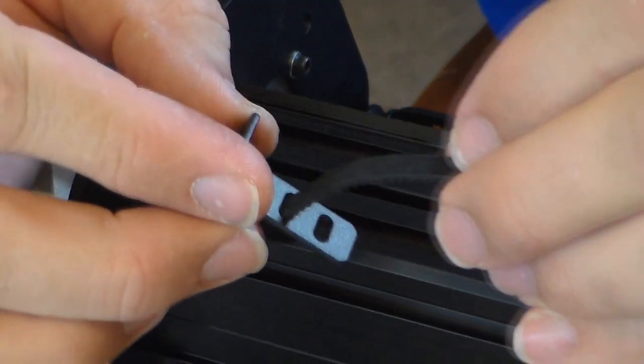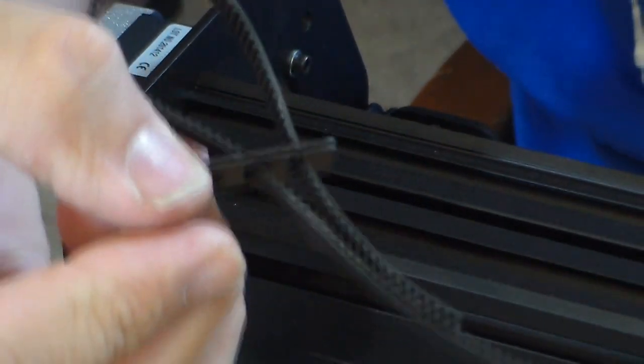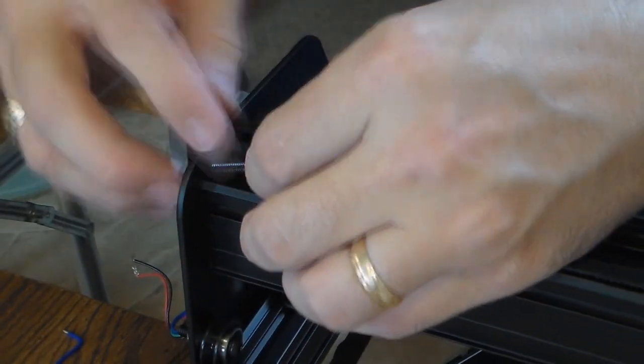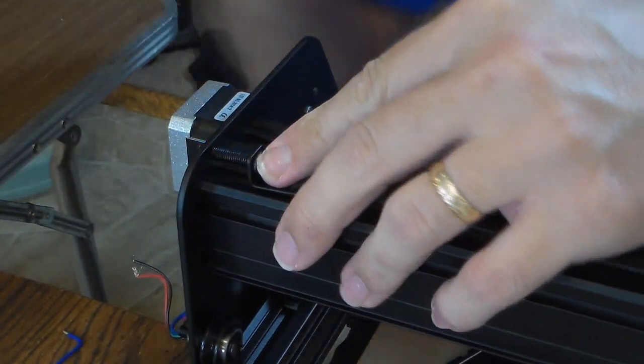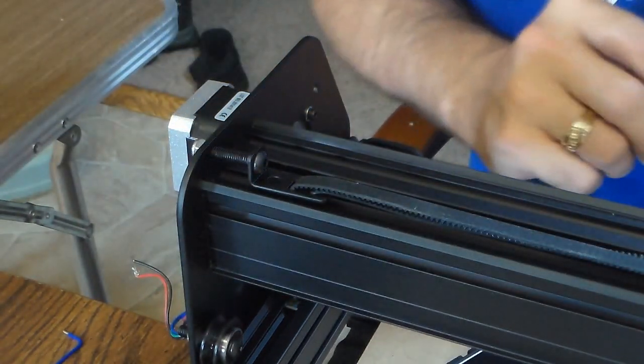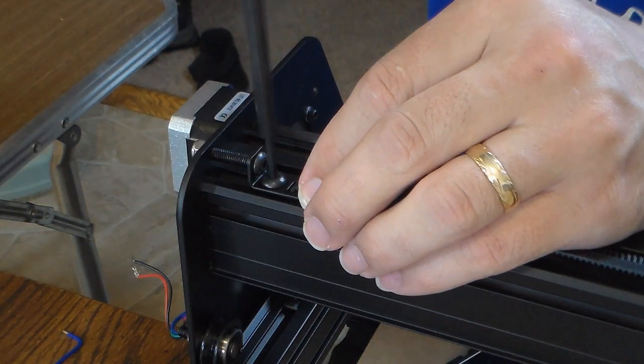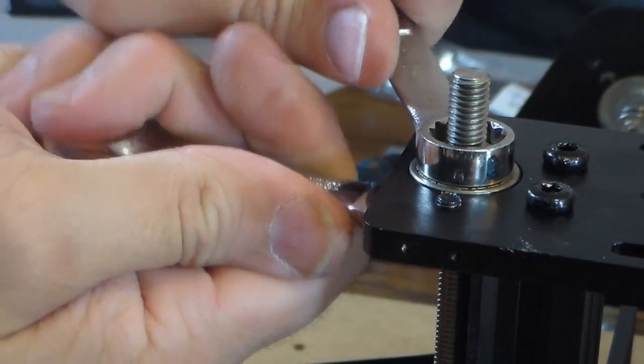Don't forget the lubrication on the self-tapping bolts. I used WD-40 and it worked just fine. For the belt, just follow the instructions — it was pretty self-explanatory after you've seen the embedded YouTube video. For tensioning, don't forget to go back on the second and third day to re-tension the belts, because that belt will stretch. And it did on mine — I actually had to redo the entire tensioning process on the third day.